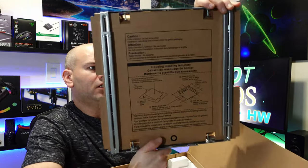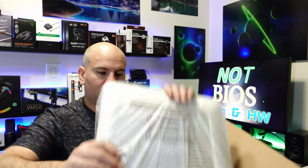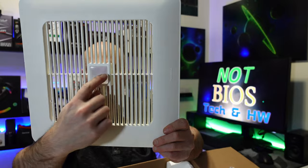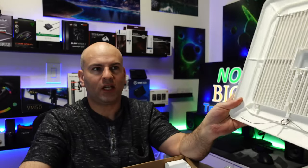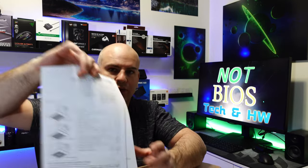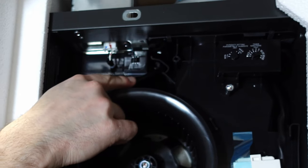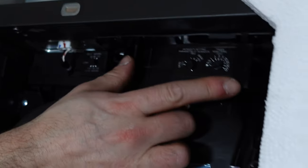Here we have a Z-bracket with a template — it's always a bonus to have a template. And then our fan cover. Right here I think is where the motion sensor goes through, but I haven't installed this before. It has these little clips that go in the housing. Then we have our manual. This is the first time I've opened this box. And then we have our fan with dials right here: 50, 80, and 110 CFM, humidity sensing. This actually has a humidistat, not just condensation sensing. It also has a timer. Here's our CFM, here's our humidistat, and right here is our timer.